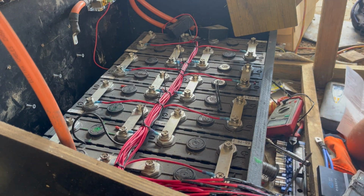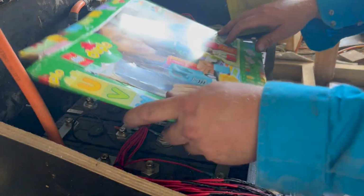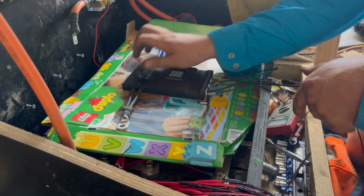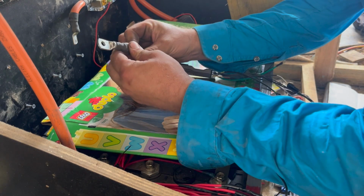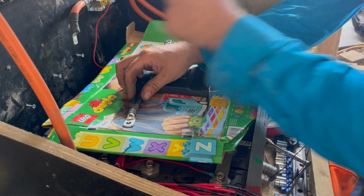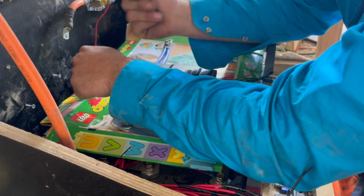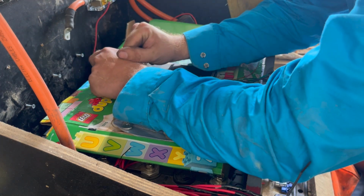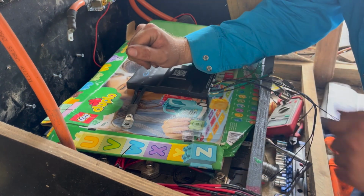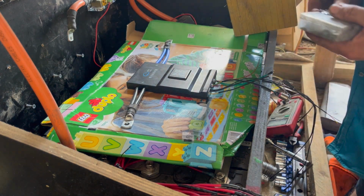And we're back. Just the last bit, we just tidied that up. And I just went away to the workbench and I got the BMS. I just crimped some cable lugs through it, two wires into the one cable lug. I did have bus bars for them to go on, but they're in the mail still, so I'm just going to nut and bolt them together, tape them. It's a bit heavy going, but it will work.